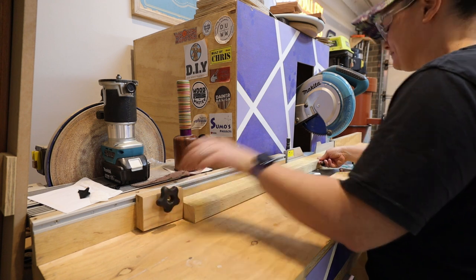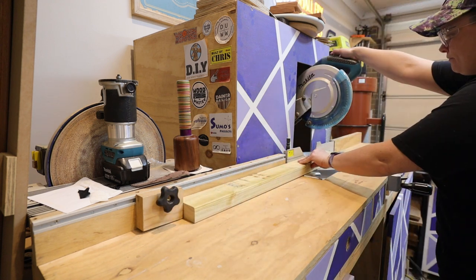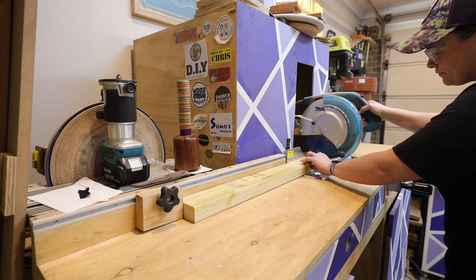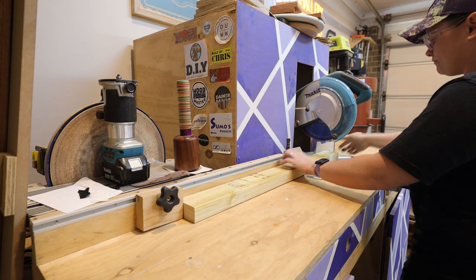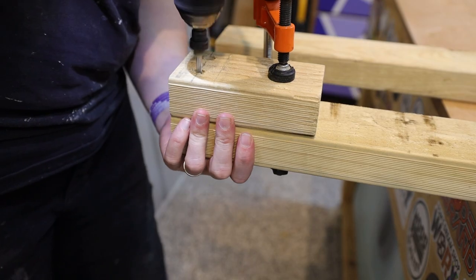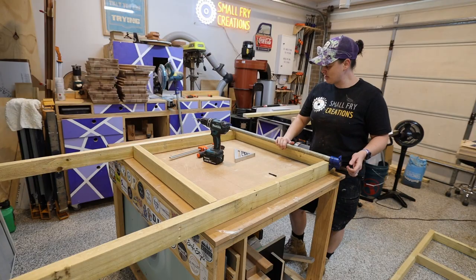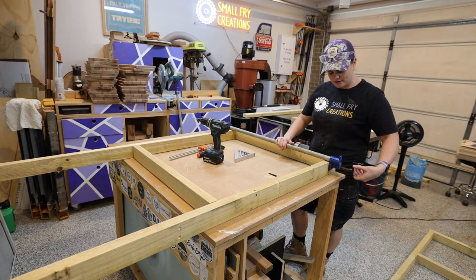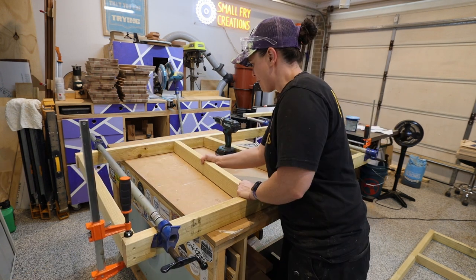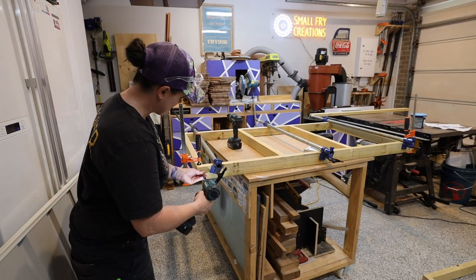The platform is made up of two sub-frames, a bit like framing for a house. I used large 70mm outdoor treated pine screws to put it all together. The mitre saw and stop block made quick work of cutting the pieces — not only does it make it quick, but a stop block ensures all pieces come out the same size. I made a quick drilling guide from scrap wood to save measuring each time. Each screw hole was pre-drilled to avoid splitting the timber, and I held everything together with clamps checking for square along the way.